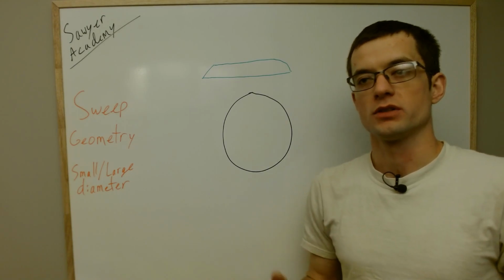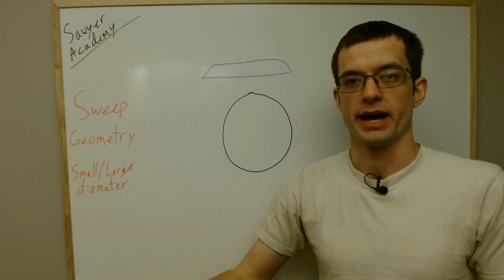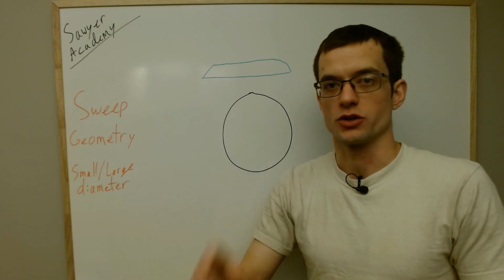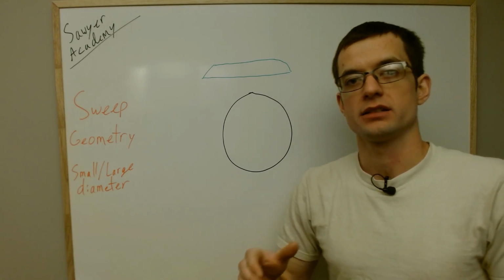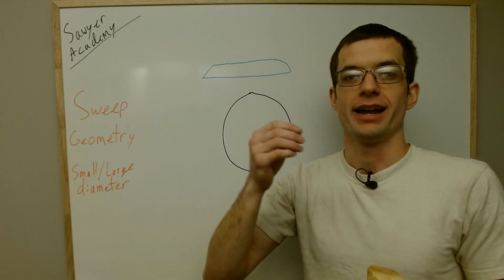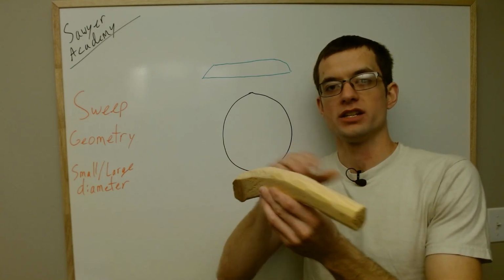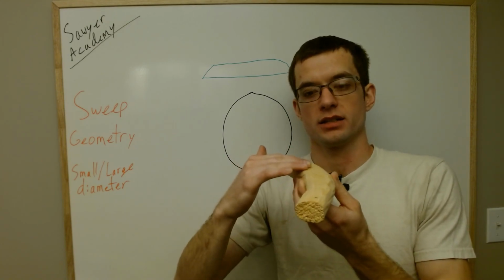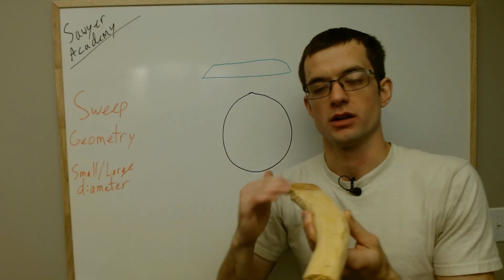When we're talking portable sawmills, I'm going to assume we have a horizontal band mill that has a bed. And regardless of how you load that log onto the bed, whether it's a tractor or hydraulics or a cant hook and a ramp or whatever, you'll always want to take the time to rotate that log to an ideal start point. And again, the same thing applies. You're going to want your horns and your bellies to be pointing off to your sides, and your flat face parallel with your saw. Again, that's assuming you have a horizontal saw.